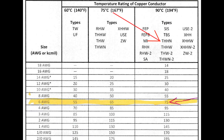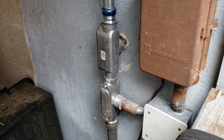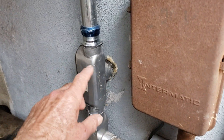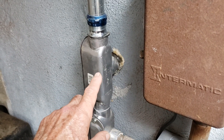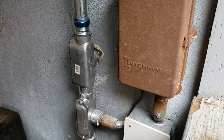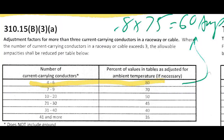We're using THHN wire, and it's rated for 75 amps. The one-inch conduit is pretty much occupied by only the four wires coming from the main panel — red, black, white, and green. However, in the section from this conduit body down to this conduit body, we have two 12-gauge wires, black and red, that feed 220 volts to the gas heater associated with the spa. Because we have that short section running those two wires carrying 220 volts over to the heater, we'll derate by 80%, which gives us our 60-amp service.